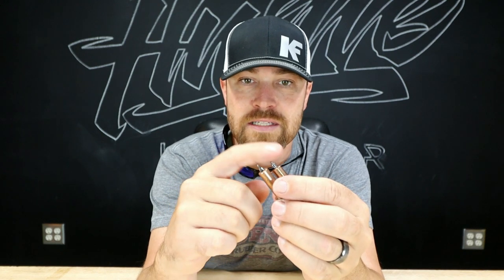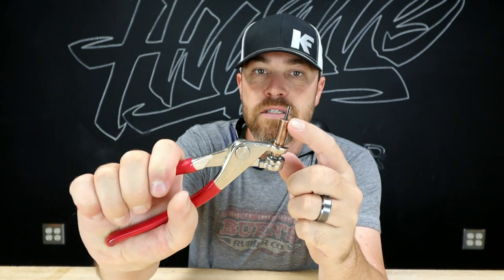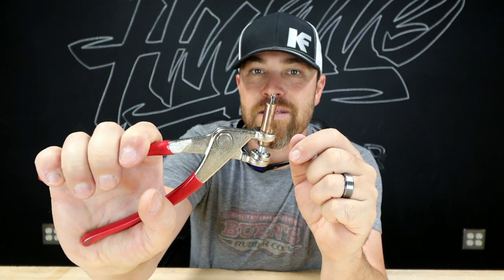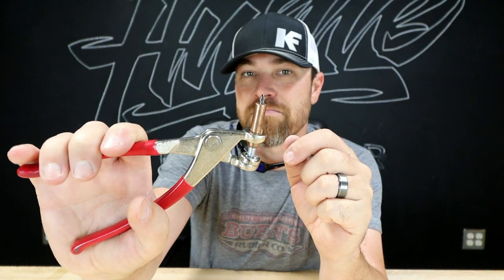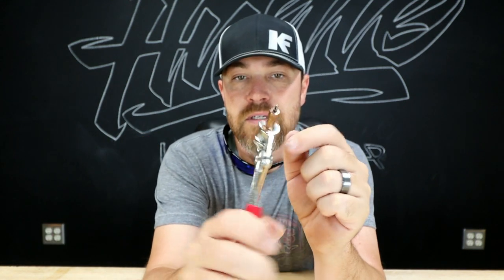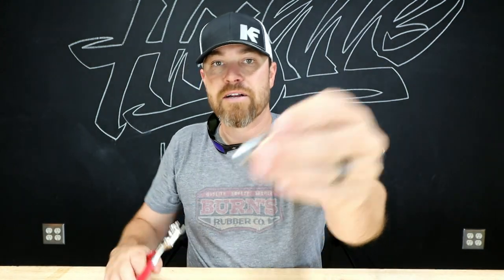These things are really awesome. They make several different kinds. You've got your standard Cleco — this one is eighth-inch. I believe they make them in other sizes as well. They also make them in different grip lengths, so the length at which it grips the material can also be changed. This one can only do maybe a quarter-inch piece of material, but you can get them longer or shorter.